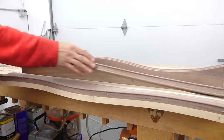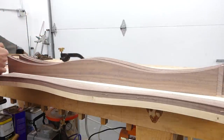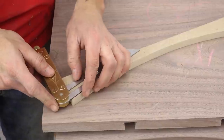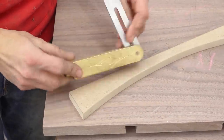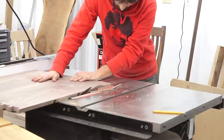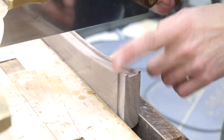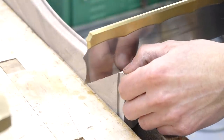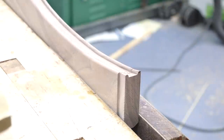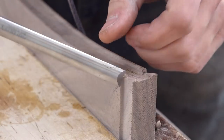So there are the finished bead details on all the pieces. From here we have two major things to take care of before we put the case back together. First is going to be to miter all of these beads here on the end, and the other thing will be to actually rip the bevel onto the front of the two case sides to match whatever's going on over here. Let's head over to the table saw. Now I get started on mitering this bead — a little bit of prep work to square up the ends of these things and get this extra waste out of here. I'm just gonna make a quick saw cut here to get me started, and then I can remove some of that waste on either side of this groove. Now I'm gonna continue this shoulder up around here to get the end of the bead.